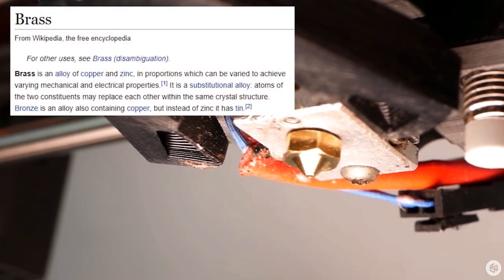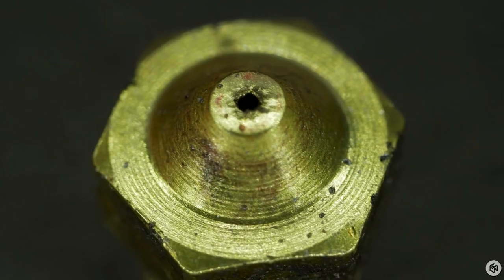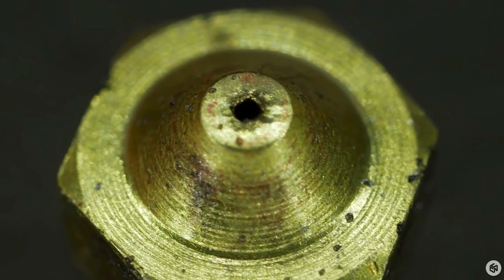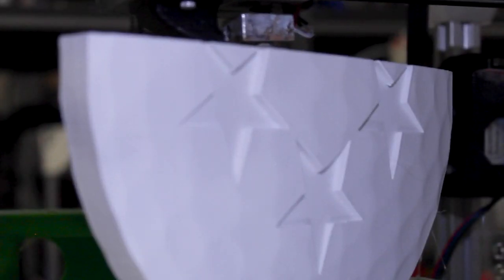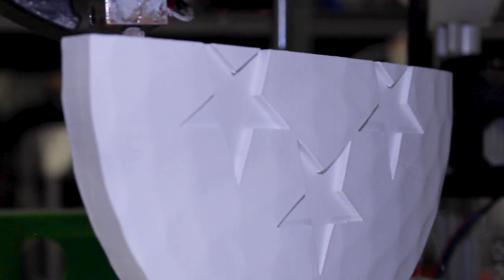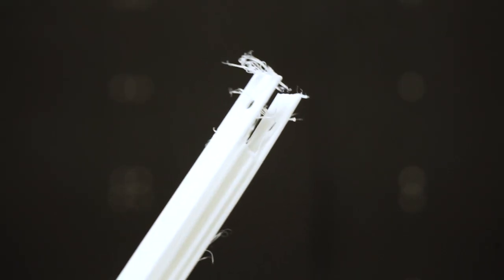But being titanium, it is very durable. So when it is processed through a machine of some lesser metal — in the case of 3D printers, a brass nozzle — it is going to wear out the nozzle before the nozzle wears on it. Titanium dioxide actually wears out machinery much more quickly. That small amount of wear throughout the entire production run of a set of white parts will cause minor degradation in the nozzle, so white parts start to look a little rougher and less smooth than other materials.